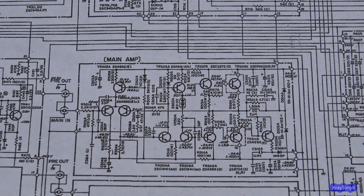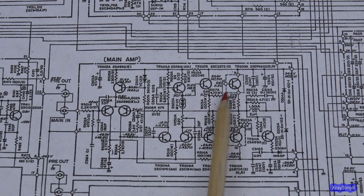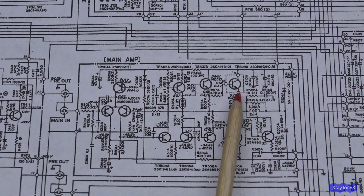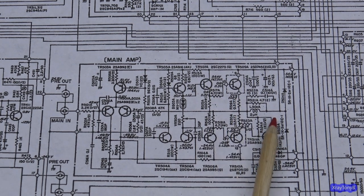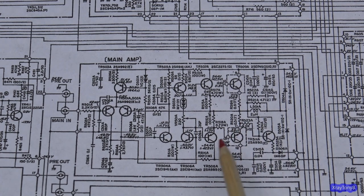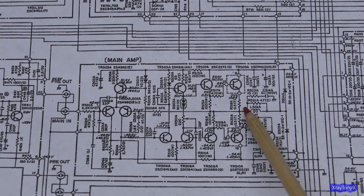Now, some people get really hair splitting about that. They want it to be right on that. But what I found is, in these types of circuits, these push-pull complementary and even quasi-complementary circuits like this, that idle current is usually set to a higher number than it has to be. If these transistors are a little bit mismatched, if these resistors are a little bit mismatched, if the gain on the transistors isn't necessarily high enough or whatever, they know that if you set that voltage drop across this resistor, these will always be turned on enough that you will not get crossover distortion. And that's really what they're trying to get around. When these transistors drive, and I've gone over this a million times, but I know I get questions if I don't go over it again.